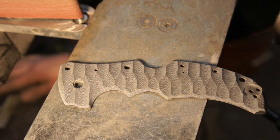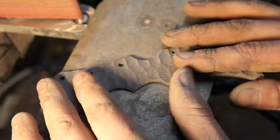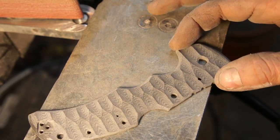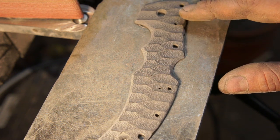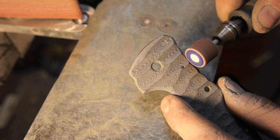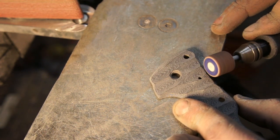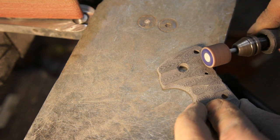Now you have a nice scale with an Anzo pattern on it. We're at 12 minutes. Now the diamond pattern - the Anzo pattern is sort of like the original pattern, the base of all other patterns as far as the Dremel patterns go. The diamond pattern I discovered by accident. I was knocking off the tips and you dig a little further and you start to get what looks like diamonds. It's basically right in the middle there where the tip is, between each one, and you do a groove again really lightly to where they intersect. This is a little harder - I'd wait until you get the Anzo pattern down before you do this.